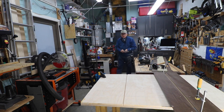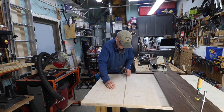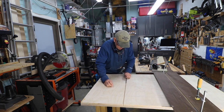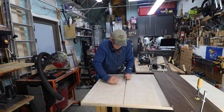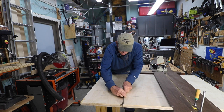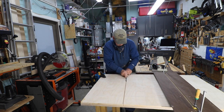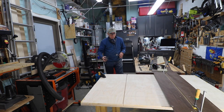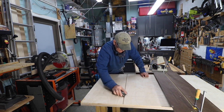But anytime you cut anything, you're leaving some little fiber edges, and that's certainly true for a dovetail groove. So I like to take just a little file. And again, my groove here is sloping down. I don't want to take that away. So I put my file at an angle, and then I just kind of get rid of these rough edges. I will usually do all of this at the end when I've cut all my grooves, but now let's get a little sanding.